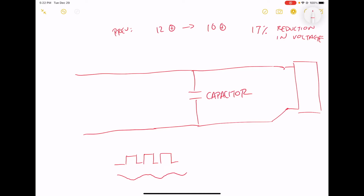So what we're going to do when we build our board is every time we put a chip, we're going to put a little capacitor right next to it. The capacitance that we usually use is called 100 nanofarads. This is the value of the capacitance that you need to put next to every chip. Actually, I really shouldn't say every chip. It should be every power supply line. Some chips have more than one power supply line, so every power supply line that the chip has should have a capacitor next to it. For example, on the 68000, I think there are 3 or 4 power supply pins, so you're going to need 3 or 4 100 nanofarad capacitors next to that chip.